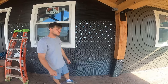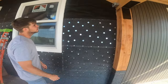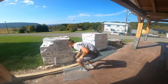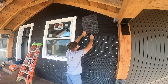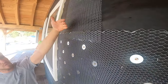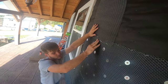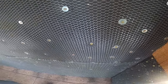One thing you're going to want to know: when you put them up, I start on the bottom right and work my way up. Up here I've got a space - I'll leave that little three inches open because you want to overlap it. I'll get a little piece of wire to show you what you should be doing. When you put it up here, you pull this out and slip it in, you overlap them. You want this part out so the mud can sit on top of it - that gives it a place for the mud to rest and not fall out.